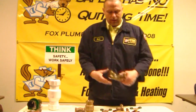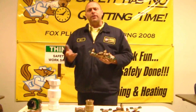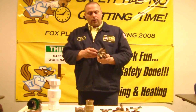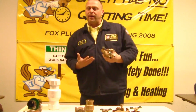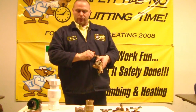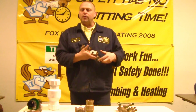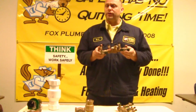One of the things I'm going to go over first — what I'm holding here in my hand is called a double check valve. Now what this is used for is, say you have an irrigation system. This is to separate your drinking water from the water that's going to be used to fertilize your lawn. The principle is to let water in but not to let anything back into your potable system. These also need to have test ports on them, so they have to be serviced once a year. This is extremely important — this is for your safety. These are used outside of the home, in applications such as an irrigation system.